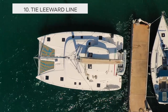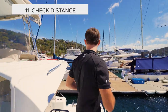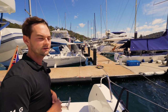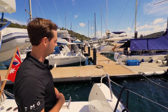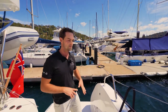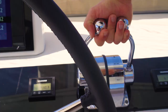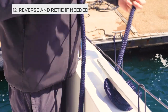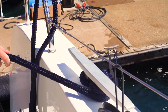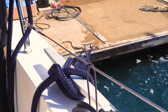Ben has confirmed both stern lines are on, so I'm heading to the back of the boat to check all lines are in the right position. With the engines in forwards and the two stern lines tight, I notice we're about two metres off the dock — that's a little too far. I'll get Ben onto the windward line, have him ready to release, then reverse the boat. As the boat comes aft, Ben will take in the slack, tie it off quickly, and I can drive on it again to get us closer. After that shuffle, Ben's tightened up the lines and we're sitting about a metre off the dock, which is perfect.